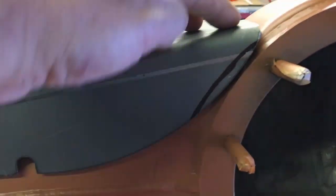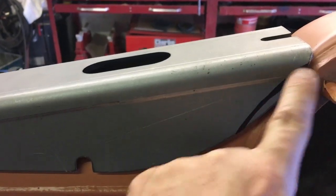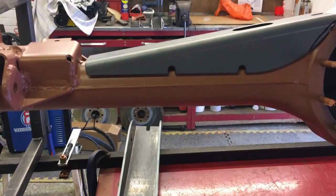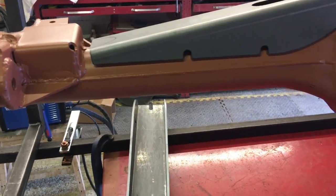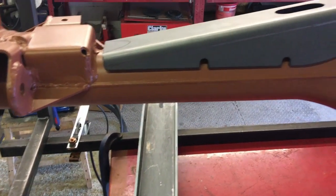When we go around the other side it's basically the same story — you can see there's no way that's going to fit on there without interfering with the diff, so I need to take that away so I can weld in there. And when we look at the side, it's just not parallel. If you look at Trainer Fitter's Toolbox, he's done a video of this and fitted them a completely different way to me, so go and watch his method and see what you think.